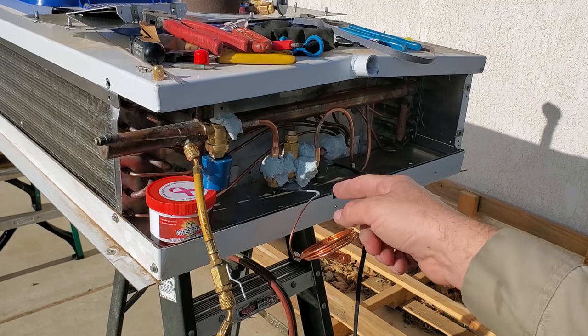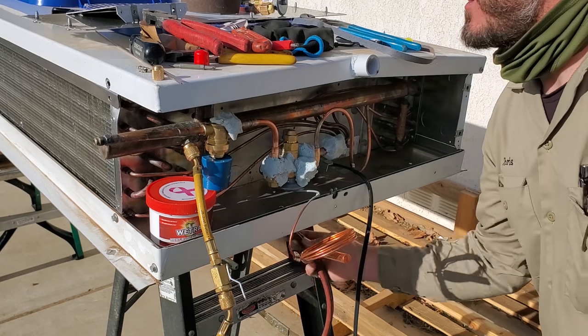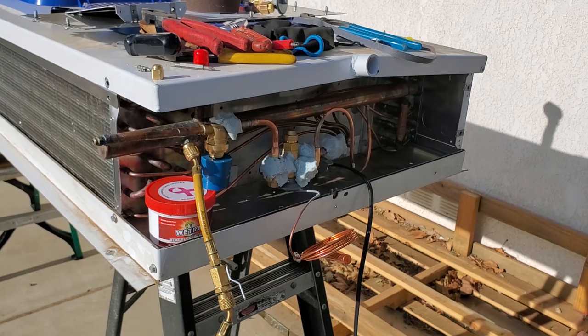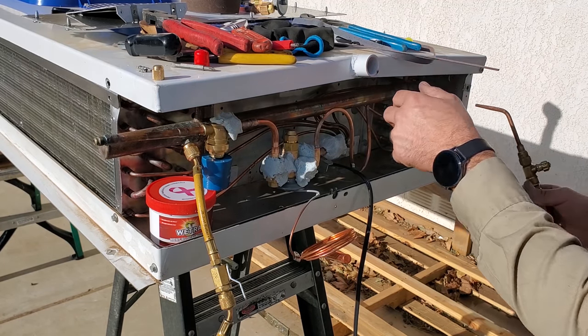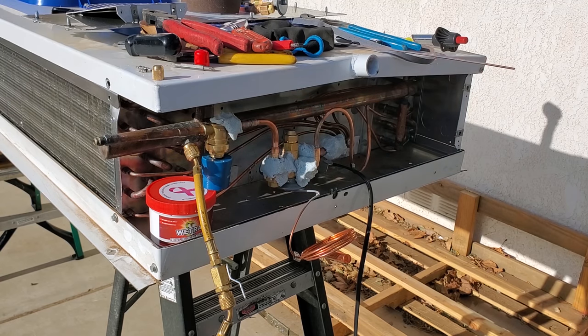You can see I'm using the Viper wet rag to protect the TXV and to prop it up. So let's get it sweated in real quick. My camera's overheating right now sitting in the sun. It's really weird because it's like 76 degrees outside right now, and it's winter. We're brazing with nitrogen.